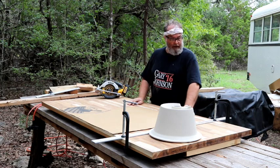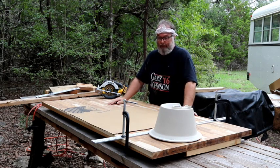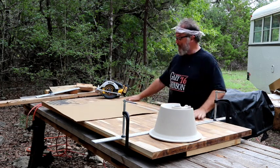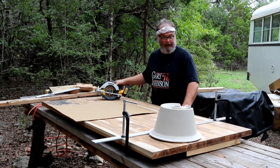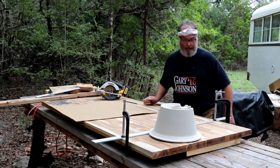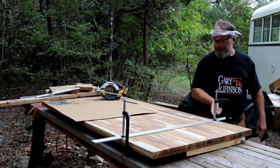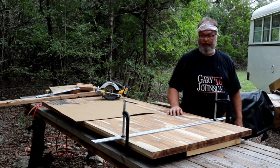The next thing you'll see is me just cutting the heck out of this thing — whack whack whack — and then cutting some curves, and cutting out the hole for the sunken cooktop embedded in the countertop. I'm going to do this by hand. I don't have a table saw or a jig big enough to cut something this big. To get straight cuts by hand, you use a skill saw cutting jig — I'm using a four-foot piece of steel to cut against, and I'm using a fine blade, so it should be almost as good a cut as a table saw — close, but not quite.